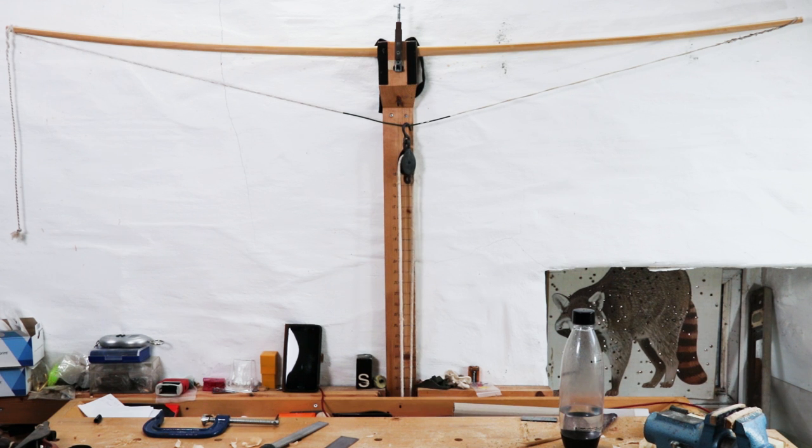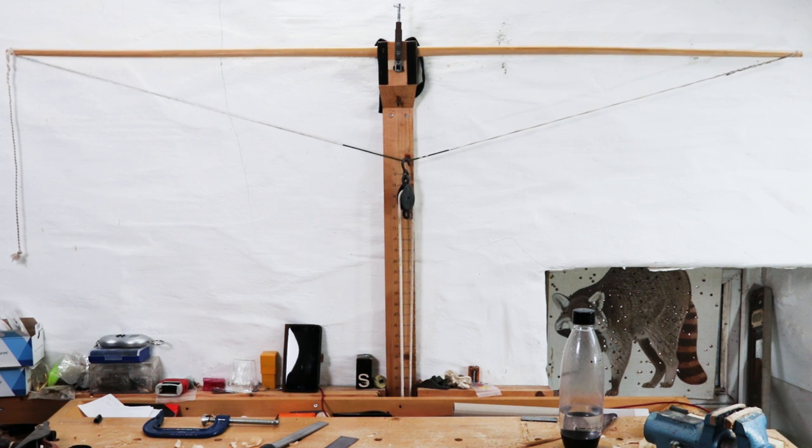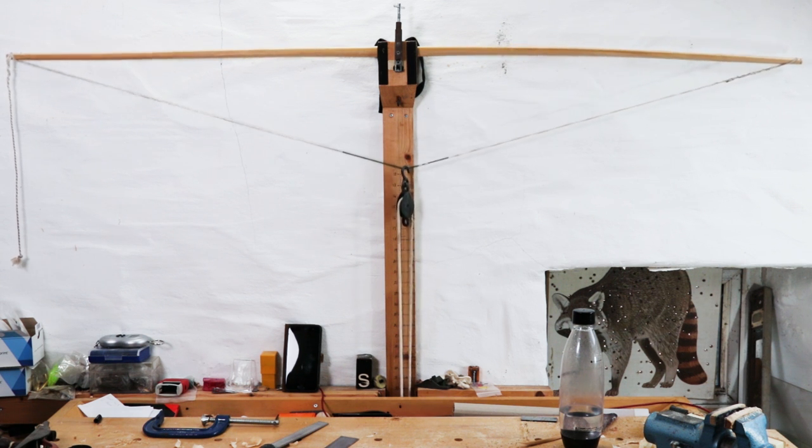We're up to the point now where we're tillering. So we've already got the tillering grooves in, which we did in the last video, and we've got the string loosely placed onto the bow, and we've got the bow up on the tiller. I'm not expecting to see an awful lot at the moment because, as I say, we've only just put it up there, but I will give it a few tentative draws on the tiller and see what shape we're getting from the bow.